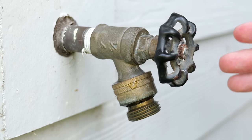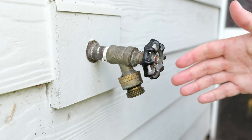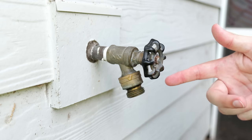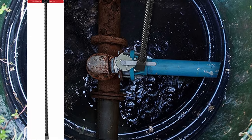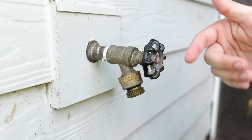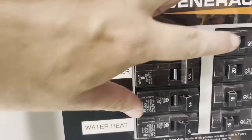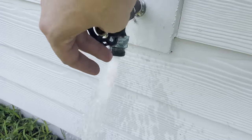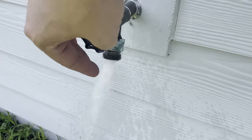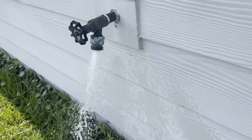For the more permanent fix, we're going to need to shut off the water to the house. If you have a main shut off on city water, it's often out at the front or in the yard and you may need a special tool. Sometimes a valve is installed between the city shut off and your house. In my case I'm on a well, so I just need to turn off the circuit breaker supplying power to my well. Regardless of whether you're on city water or a well, once the water is shut off, open up the hose bib and drain all the water out of the lines so you're not dealing with any pressure when you take it apart.